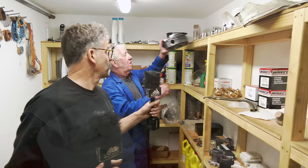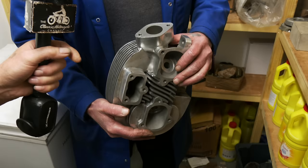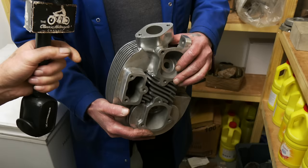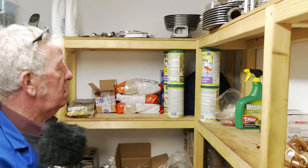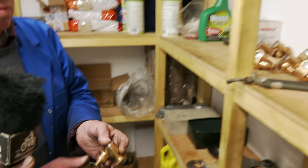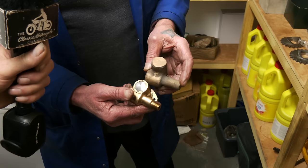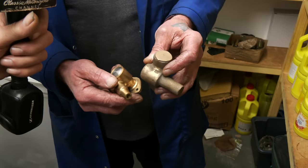In Phil's storeroom we look at various parts he's made. Here's one of his heads - cast and then machined up. That's a nice head, slightly altered with the fins polished up. He still needs to do the ports and put the seats in. Up the end there's a barrel for his engine. The mag straps at the top are all produced by Phil in stainless steel. These are the rev counter drives - cast to start with, then machined with all the gearing inside. Phil buys the gears but makes the shafts.